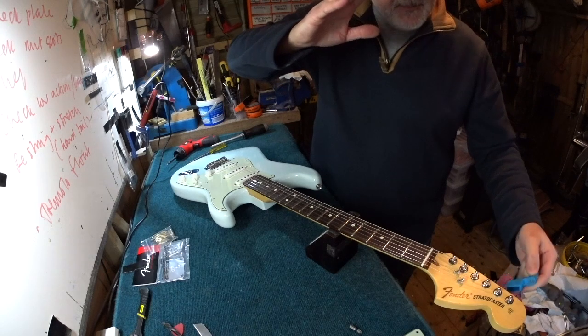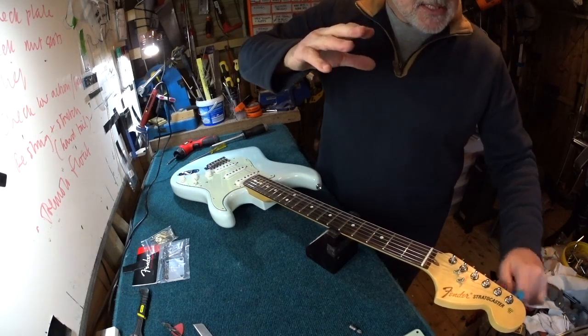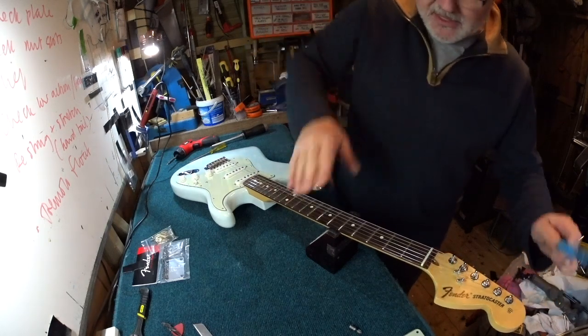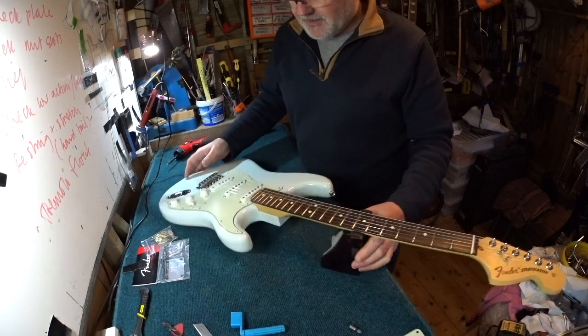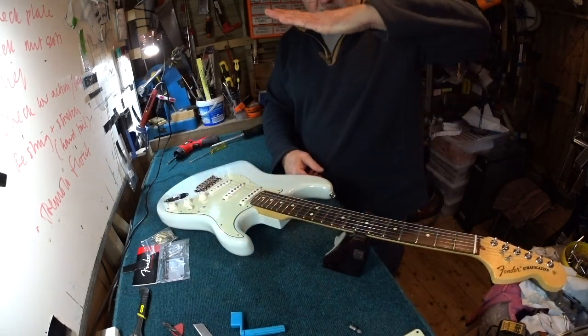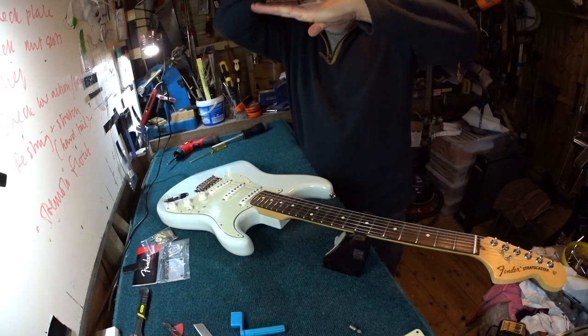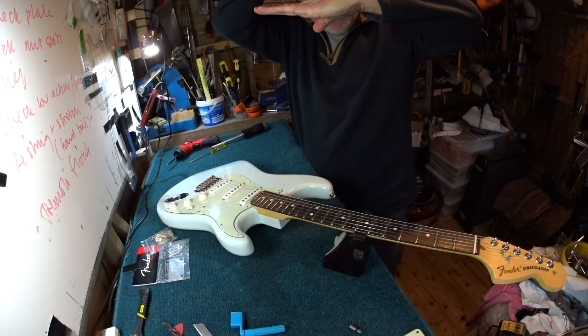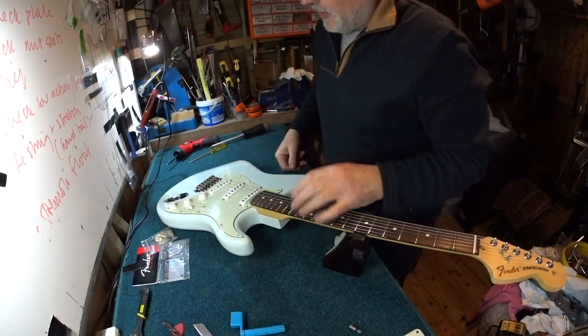There's a chamfer on the front edge of the plate, and it's designed to allow the plate to do this rocking business. The problem is if you over tighten it to begin with, you push it down onto its chamfer, which kicks the back end up, and you've locked this end down. Really, it has to sit up like that. Over tighten it, and it goes like that. I could draw it on the board, but...